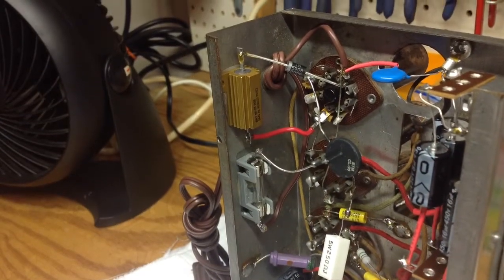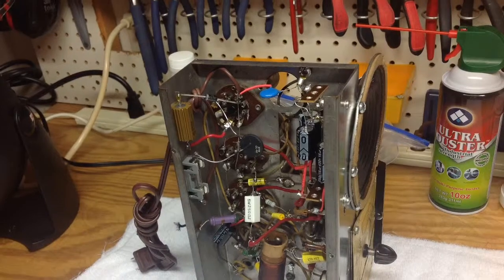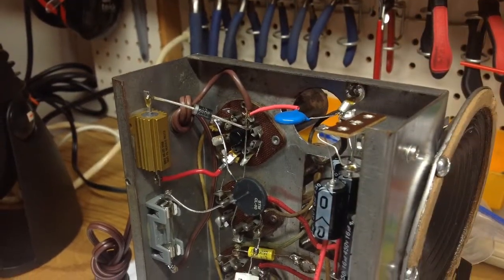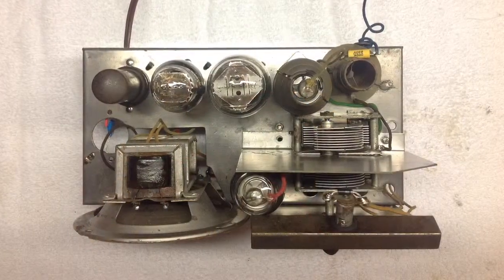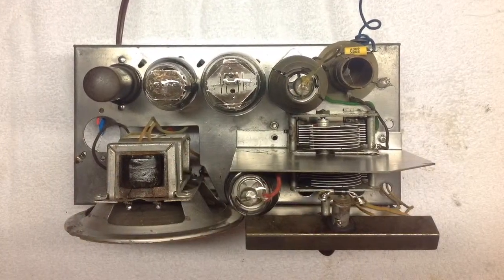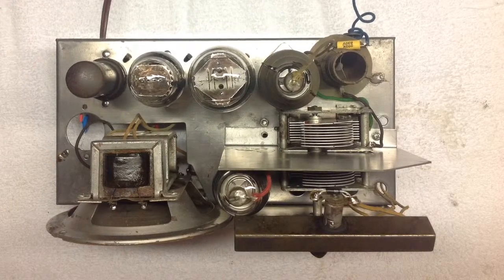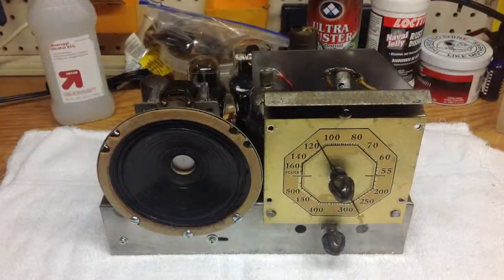In addition, I used a diode to replace the ballast tube, and also a power resistor to reduce the voltage. That worked out well. The ballast tube is still in the tube socket but bypassed — it's there just for aesthetic purposes only. Here's the top view of the radio chassis and the front side of the chassis before reapplying the dial plate cover.